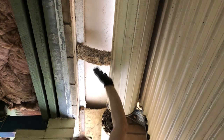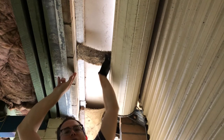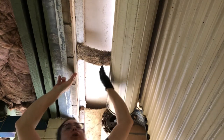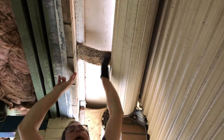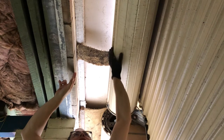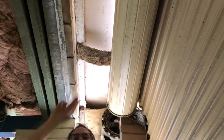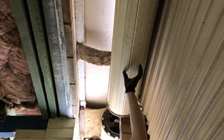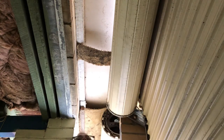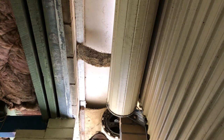When you are doing this, it is quite important to know that the carpet is actually resting on the top of the garage door and has a bit of slack in it, because as we roll this door up, this span is going to grow bigger. If the carpet is pulled too taut, it will either put pressure on the garage door — which could damage it — or pull out your fixings. So make sure you've got just enough slack for the carpet to mould itself to the shape of the door.